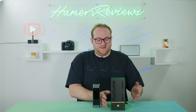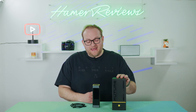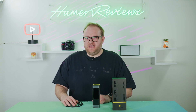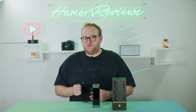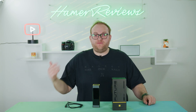Inside the box — which is really nice and snazzy — at the bottom you pull out the inner section, and it also includes a USB-C cable. USB-C cables are really important at this level of device, because there's added attention you need to pay to what the cable is rated at. When you start hitting above 80 watts, you might find that the USB-C cable you've had hanging around for five to ten years isn't actually capable of fast charging. There have been various standards of USB-C cable and USB-C power delivery. The cable included with this box is 140 watt capable — so keep this charging cable with the device and you'll always be able to use its maximum output.